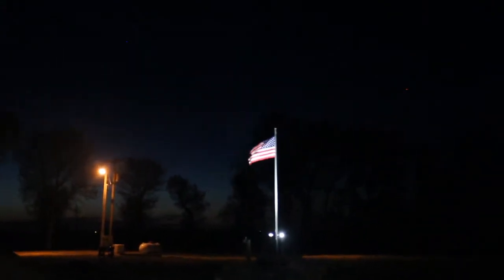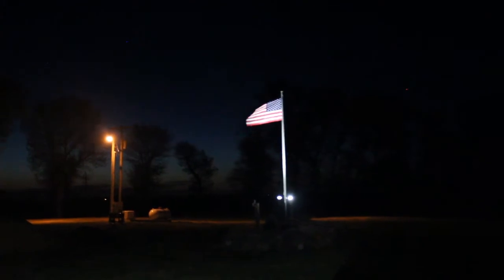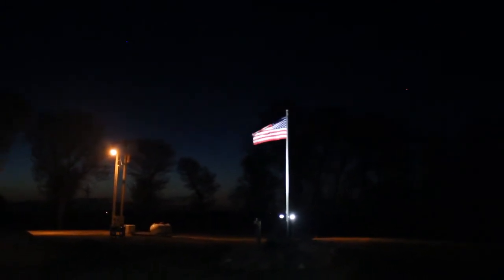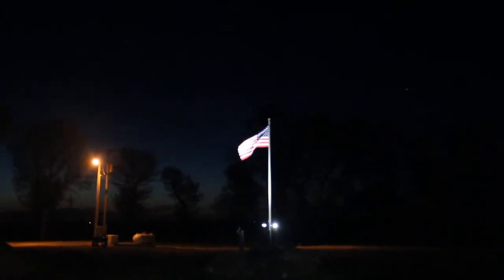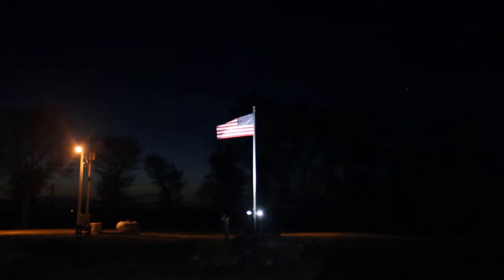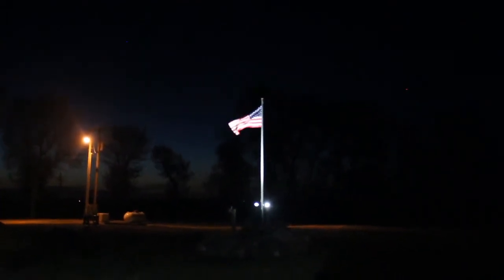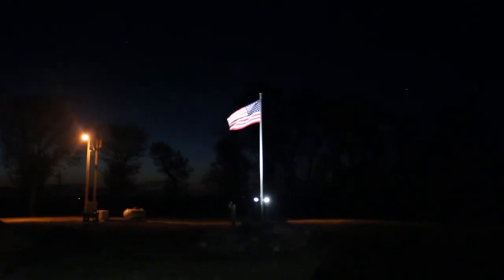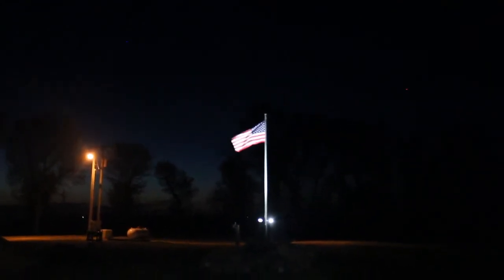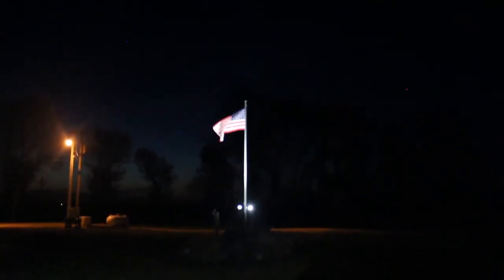There's our handiwork — got the lights and the flag. That was the whole reason for renting the E35 Bobcat mini excavator. We got it all put in, and now we can start rebuilding the landscape flower bed around the flagpole. We have two 800-lumen LED outdoor lights on it, all controlled by a photo sensor on a switch, run directly from the shop. All in conduit — three 12-gauge single wires. We opted for conduit mostly for a cleaner install, so if we ever need to get in there with an excavator again we don't have to worry about it. Pretty happy with the overall project.